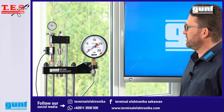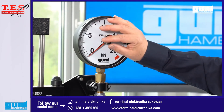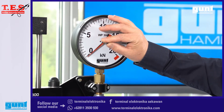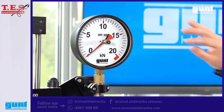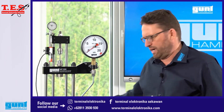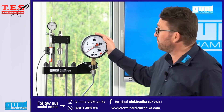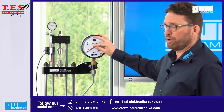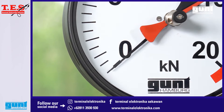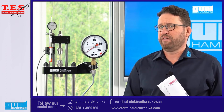Let me point out some of the unique features of the WP 300. Here we have the large force indicator. Due to its large size it is perfectly suited for the traditional teaching environment. It is actually a pressure gauge which indicates the hydraulic pressure in the actuating system and it is calibrated in kN. It also comes with a trailing pointer which, when reset at the beginning of the experiment, automatically indicates the maximum test force at the point of specimen failure.